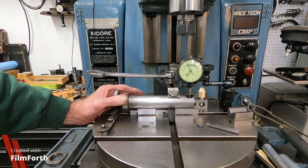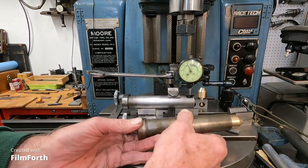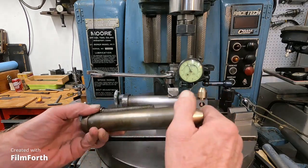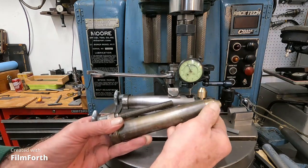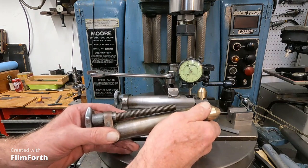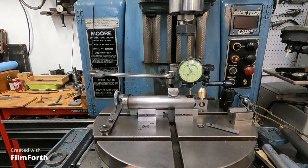As can be seen, clamping things in a vise — I showed on the milling machine that the vise can stretch a couple thousandths if you torque on it a little bit. But this job here I'm doing for myself is for my steady rest. I've got to get some set screws to locate the tips that I machined this for. I'm going to have roller tips here, so they kind of have to be indexed. I want to have a set screw at 90 degrees to the adjusting screw so they track okay. I'm going to take a few precautions to get there.